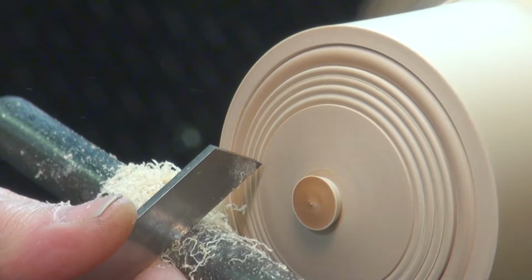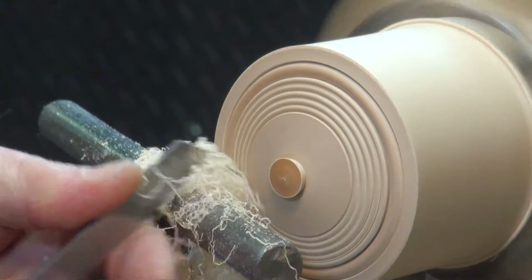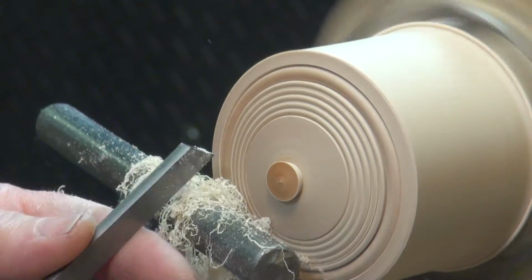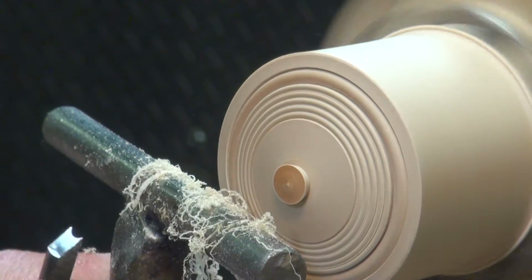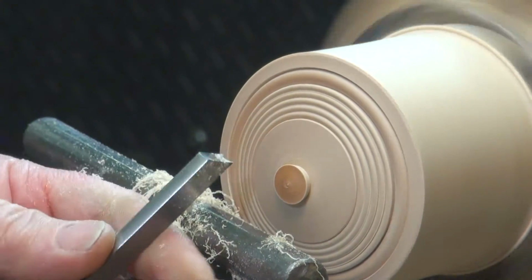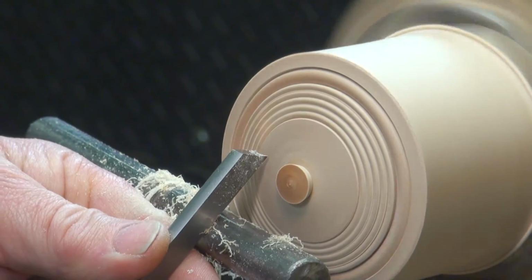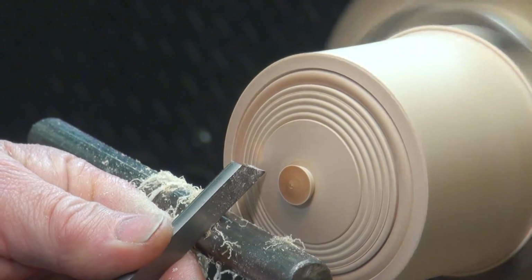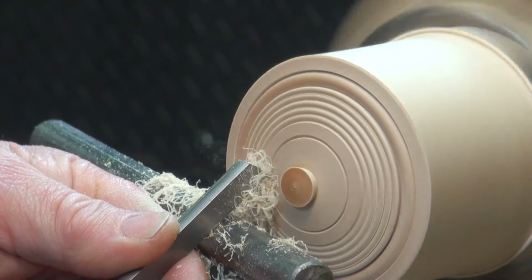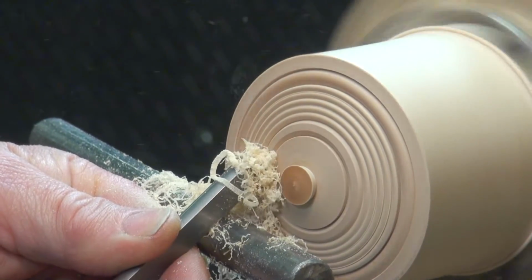We get these done, I'm going to swing around and put some on the side grain also. Now when we get close to the center here, this is very important for us to be on about this center line that's right across here. Because if we're way up here like this, you can see we're going to wind up with not a full bead. So we want to be really close. I mean, it doesn't have to be dead on, but we want to be fairly close. Here's to the right, to the left, to the right, to the left. You're going to use these.